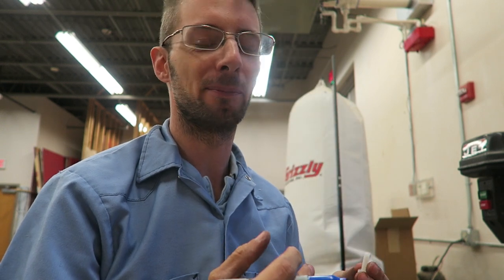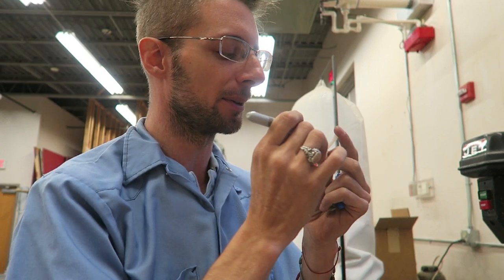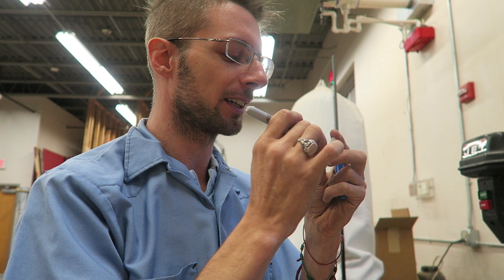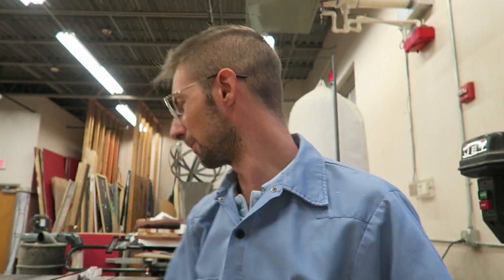So I've got my nylon bolts, and these are actually what hold the camera to the mount. I choose nylon because it's going to be more forgiving on the camera. I'd rather have the bolt threads give out than the camera threads rip out from the bottom of the camera. I'm marking them 5 up, and that's where I'm going to cut them. Now, I've done all kinds of things before. I've actually just taken a knife and pressed it into these, and they cut off fine. I've also used the tabletop disc sander, and I just push them and it grinds them down.